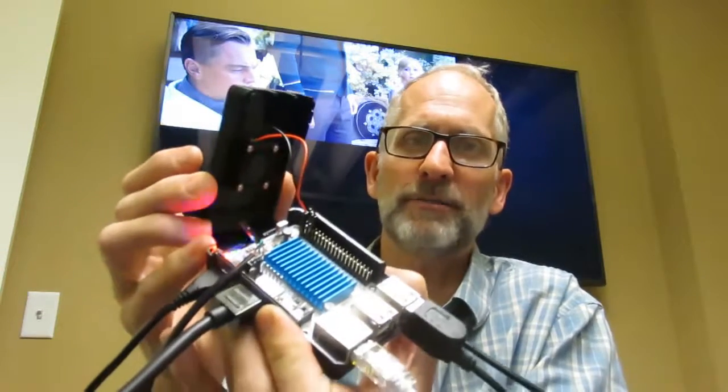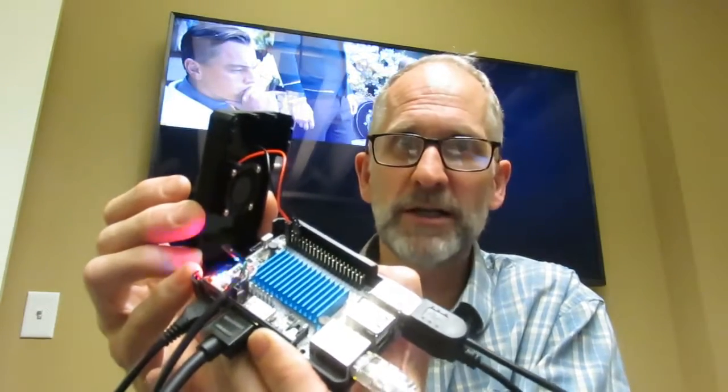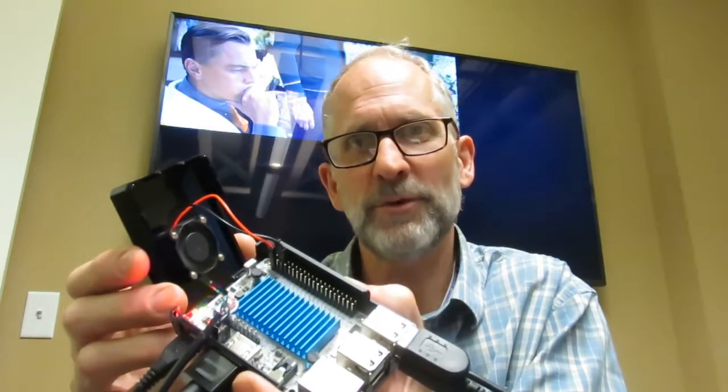This has been a demonstration of the AM-S905X single board computer by Libre Computer. We've seen this device playing back HEVC at 4K resolution at 60 frames per second, also VP9, and it did so perfectly, but using a very old Linux kernel and proprietary drivers that are not very maintainable.